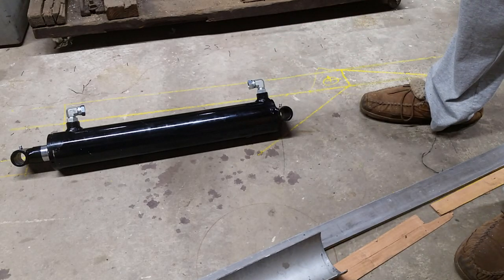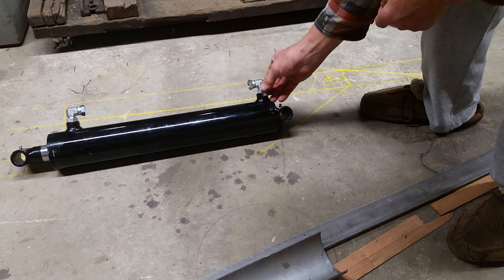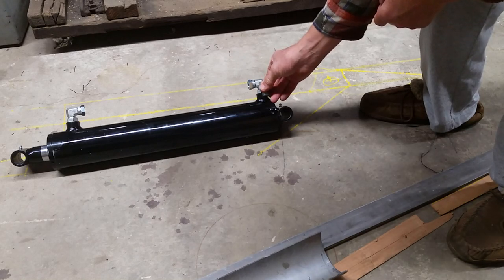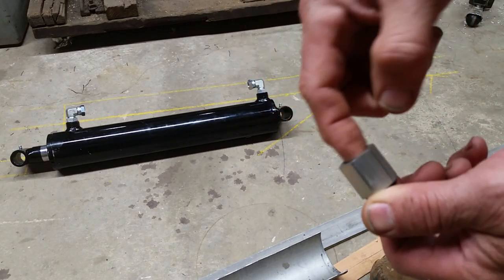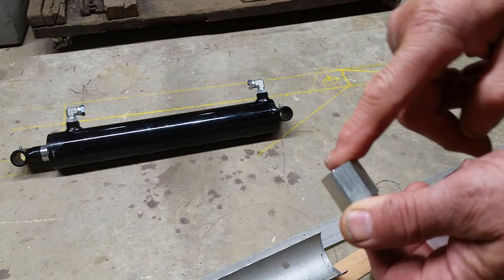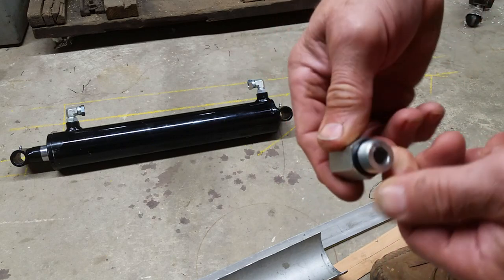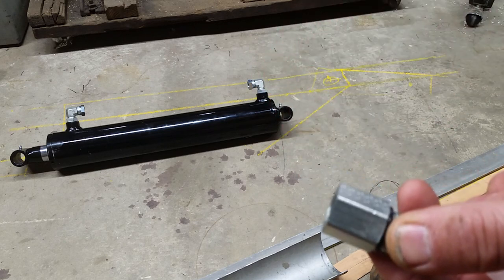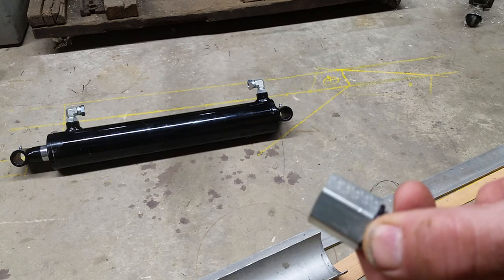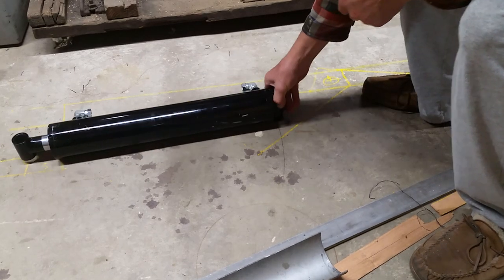This is strictly O-ring seal to NPT straight. This is a right angle to NPT swivel. What I'm going to do, because I really think it'll fit then, is I am going to take this guy and put a plug in him, flush, and then I'm going to drill and tap an NPT quarter inch in the side. Now, this is probably 3/8, but the hose I have is quarter inch. So I'm probably going to go straight with quarter inch so that I can just screw it right in. And that should give me the ability to turn this cylinder right side up.